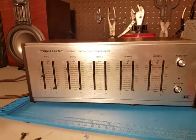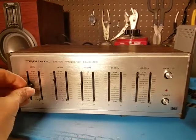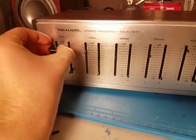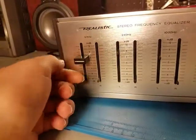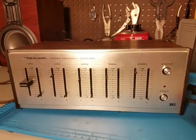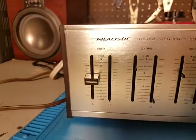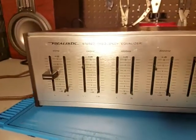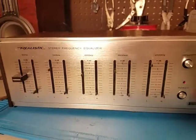The problem with this is that I have it on the left channel only right now — I muted all the right channels — and I'm just going to use this slider, because the problem is with this slider. Audio cuts out whenever it gets above plus 4 decibels. It's happened like that since I got it, and it only really does that once it's warmed up and played for a little while. I did try the trick of putting some quick freeze in there to get it really cold really fast, and it didn't solve the problem. So I'll demonstrate the problem now.